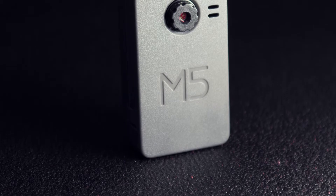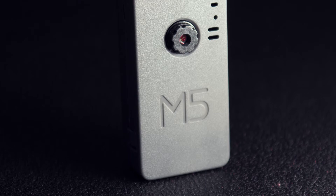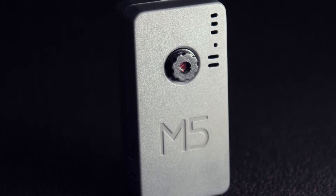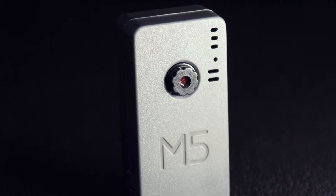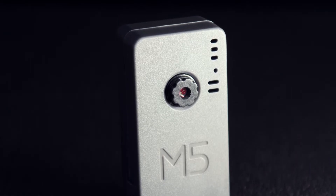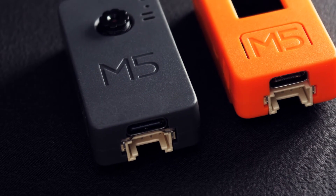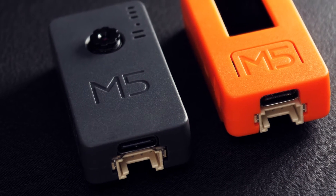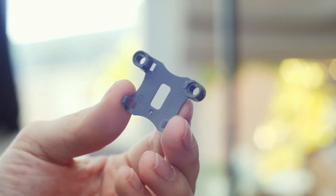Essentially, the Timer Camera X is a mini camera module attached to an ESP32 microcontroller. This means it can be programmed through the Arduino IDE and made to do all manner of things, including AI image recognition. Thanks to its built-in Wi-Fi and Bluetooth connectivity, it's perfectly suited to DIY smart home projects. It charges by USB Type-C, has the usual M5Stack Grove connector on the base, and comes supplied with both a wall mount and a Lego Technics compatible adapter.